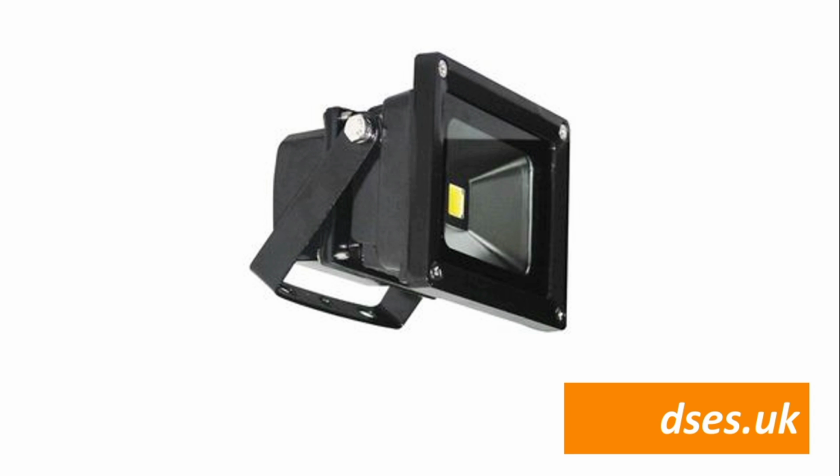Basically, there's air trapped inside your floodlight, and that air is warmed by the electronics when the unit is in operation, causing it to expand and increase the internal pressure. Some of that warm dry air will be forced out where the seals are imperfect, but when the unit is turned off and cools down again, the remaining air inside will contract, now causing a negative internal pressure. As a result, the air outside, which may have a high moisture content, will be pulled in.